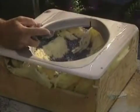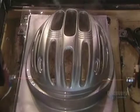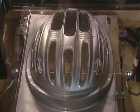Next step: trimming the helmet to eliminate excess polymer. The circumference is manually cut using a router. The edges are then sanded to even them. It is also possible to cut the circumference of the shell with a heated wire. This operation takes more time, but is more precise because of the resulting cleaner cut.